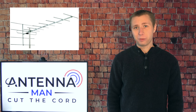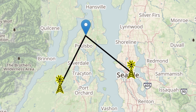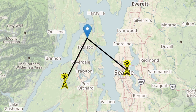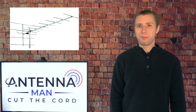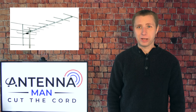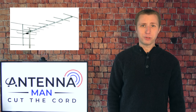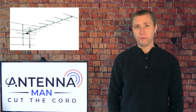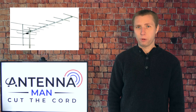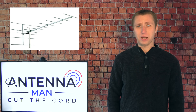Another situation where this antenna could be a huge advantage is if you have a VHF channel that comes from a different direction than the other stations in your area, like the case of FOX13 in Seattle, Washington. As of December 2020, I can confidently say this is the best high VHF antenna on the market. It truly impressed me. Test after test, I found most small antennas pick up my local VHF channels at around 45 to 60 percent, larger antennas between 60 to 70 percent. I never knew it was possible to pick them up with close to 80 percent signal. That 10 to 20 percent signal gain can be the difference between a reliable, watchable signal and nothing at all if you live in a very weak signal area.